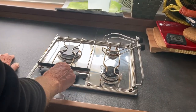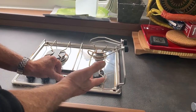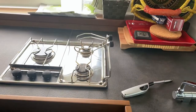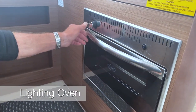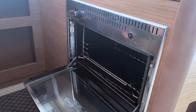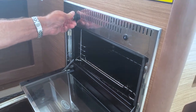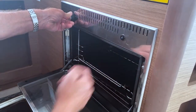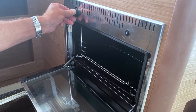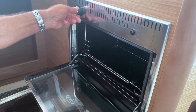You also have a piezo lighter — you can press that down and hold it and it lights by itself, though it's not 100% reliable so it's good to have a manual backup. To unlock the oven, move that lever across and up, then undo the door and slide it out — it makes lighting much easier. Sight through the hole, rotate to light, put that on the burner, and light it. Hold it for five seconds. If you want it to simmer, go to the smaller flame; for full heat, up to the big flame.